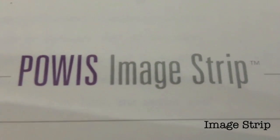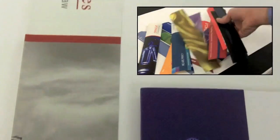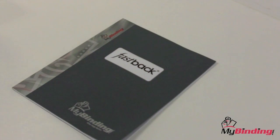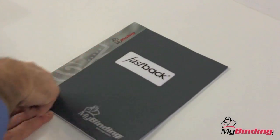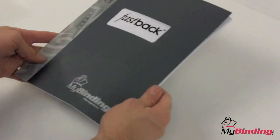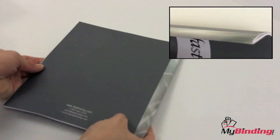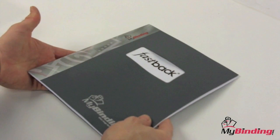Finally, let's have a look at the Powis image strip. An image strip is a Powis thermal binding strip that has an image printed on it. This image can consist of photographs, vector art, and various color specifications. The strip is wider along the front edge to allow for larger graphic elements in the cover of the document. This bound book is an example of an in-house MyBinding booklet where the content features information on the Fastback — both the binding as well as the front cover speak of our company. The binding capacity of an image strip is from 10 to 100 sheets of 20-pound paper, or 0.4 inches thick. The static front flap shown here is 1.2 inches wide.